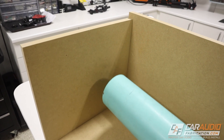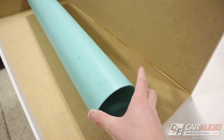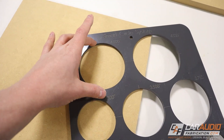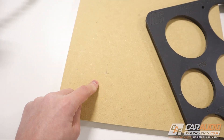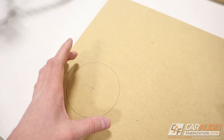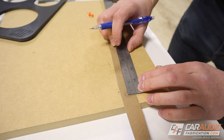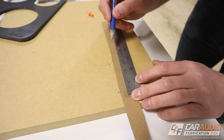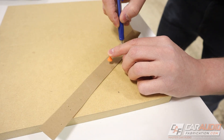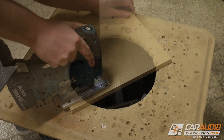First, we have to cut a center hole that matches the inner diameter of our port. My PVC piece is a four-inch inner diameter, so the hole needs to be four inches. I'm using a circle template on the router, but if you're using a jigsaw, here's a handy trick: mark the center location of the port, then take a piece of cardboard and poke a hole for your pencil lead. Measure the radius — half the diameter, so two inches in this case — and poke a pushpin through at that measurement. That's your pivot point for drawing a perfect circle. Then drill a starter hole for the jigsaw blade and carefully cut out the circle.